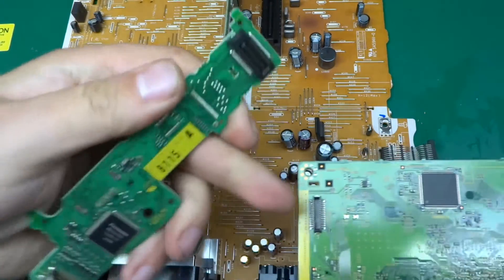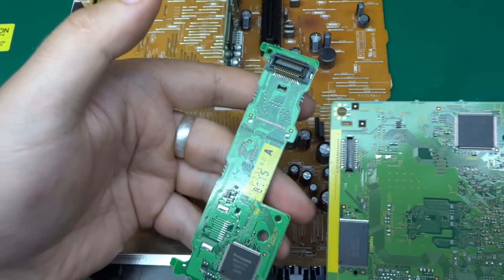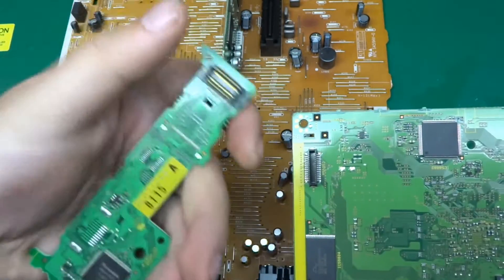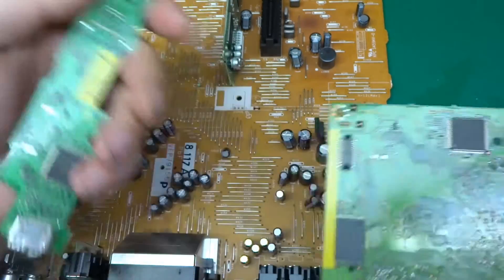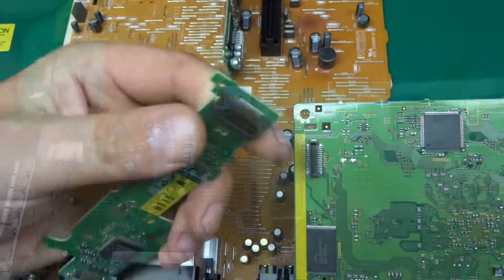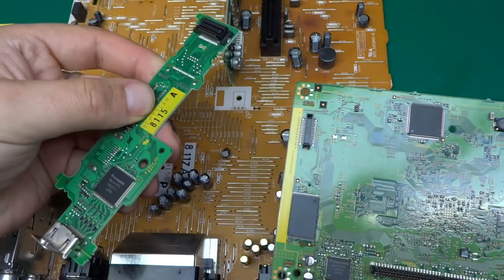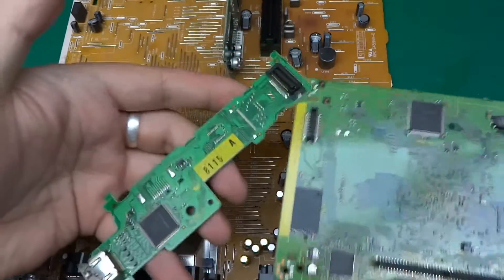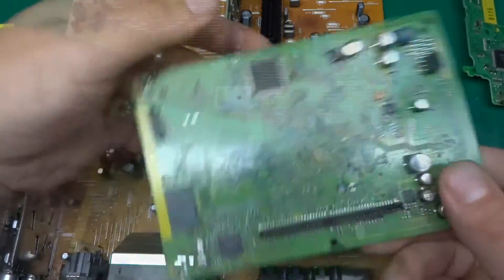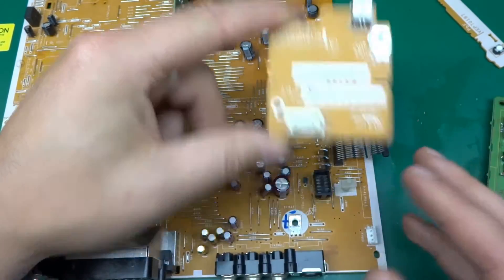Another interconnect over here. Remember, this is consumer gear — it's got to be cheap enough on the shelf in the store. So people buy it, and connectors, especially fancy connectors, are not cheap. This stuff costs quite a bit of money, possibly more than quite a lot of the chips here. So why are they doing it like this? If you stuck this board directly onto this one, the connector wouldn't have to be there, and that would surely be cheaper — one part less. But okay, maybe this board is used in something else in large quantities.